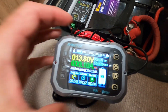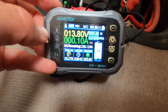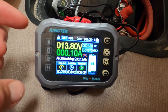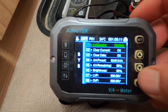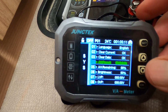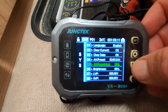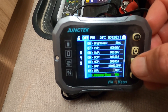I've plugged in the display screen so you can see what's going on. The supplied cable plugs into this port and into the back of the screen. Now we can see a readout: the battery is at 13.8 volts, fully charged, and at the moment it's just charging at 0.1 amps — very little. It's showing 98 percent, so basically fully charged. To configure it, you press 'set' and there are setup screens. I set the battery capacity to 240Ah and the percentage remaining to 100 percent. There are also over-voltage and under-voltage protection settings, but those require a relay which I haven't purchased.